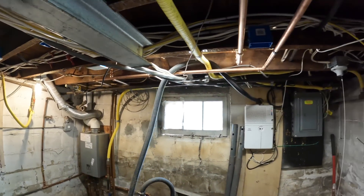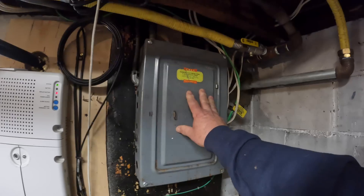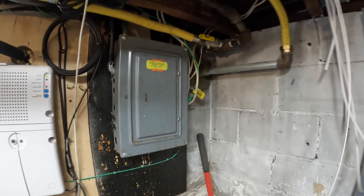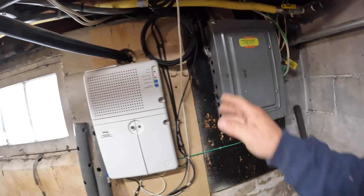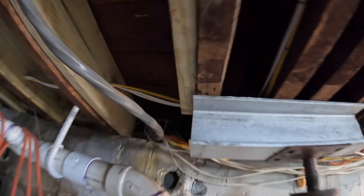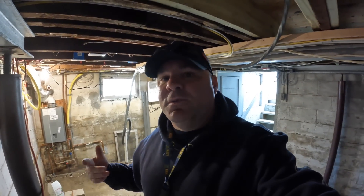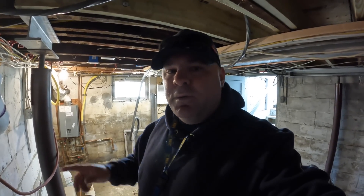These lights are just temporary. This is where the original 1920 service was — that's definitely not the original panel, that was probably upgraded in the 70s or 80s. What they did was eventually move all the circuits out of here and bring them through on a feeder to a subpanel that used to be in a hallway but is now in the kitchen. One of the first things we're going to do today is change that panel cover, because it's covered with paint and there are fewer circuits in there now — just straighten it out and make it look like new.